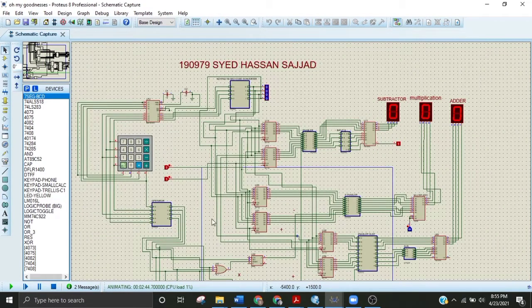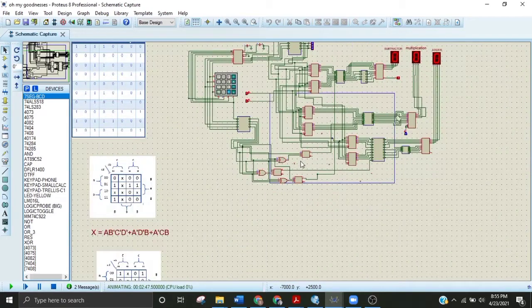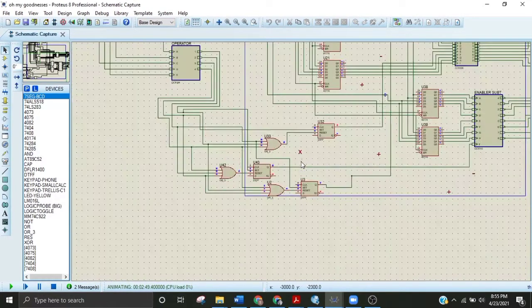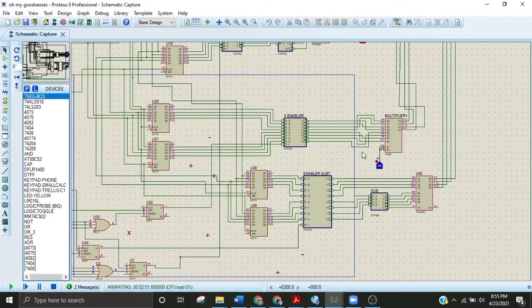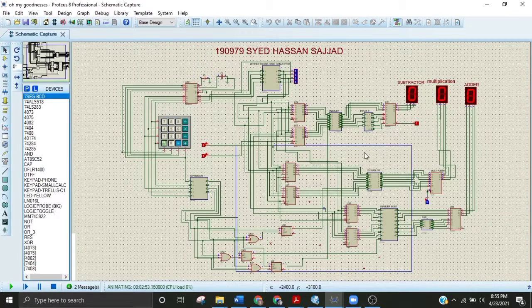All the other remaining inputs will be zero, so the value one is stored here and goes towards the enabler, which enables subtraction, multiplication, or addition according to the button pressed. If you apply plus, the addition latch stores one and enables the addition circuit. If you press multiplication, all other latches deactivate and only the multiplication latch activates, enabling the multiplication circuit output. That's the work for today — I hope you enjoy this video. Please like, share, and subscribe to my channel.